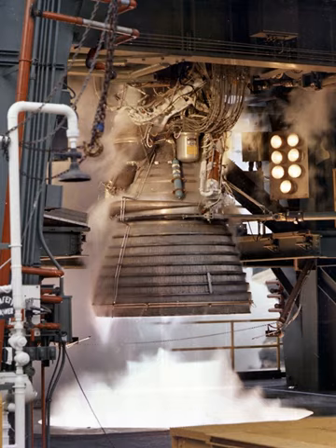When the engine was used in the S-2 stage, a one-second fuel lead was necessary. The S-IVB utilized a three-second fuel lead for its initial start and an eight-second fuel lead for its restart. After an interval of 0.450 seconds, the start tank discharge valve was closed and a main stage control solenoid was actuated to: turn off gas generator and thrust chamber helium purges; open the gas generator control valve; open the main oxidizer valve to the first position, allowing LOX to flow to the LOX dome; close the oxidizer turbine bypass valve; and gradually bleed the pressure from the closing side of the oxidizer valve for smooth transition into mainstage. Energy in the spark plugs was then cut off and the engine operated at rated thrust.